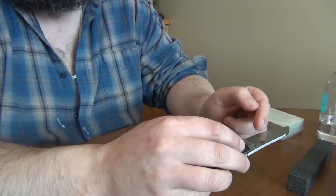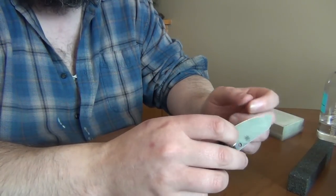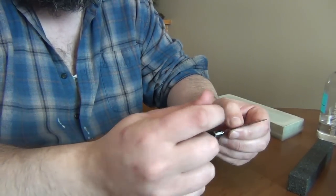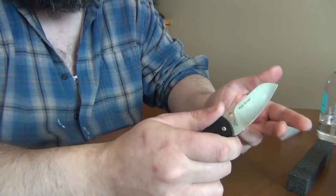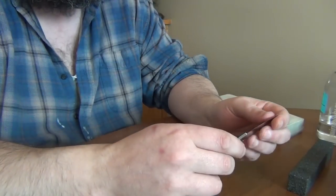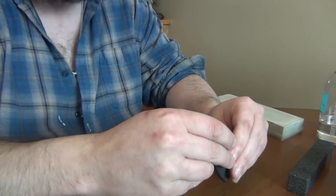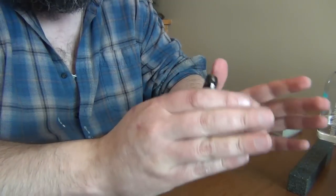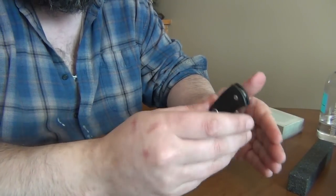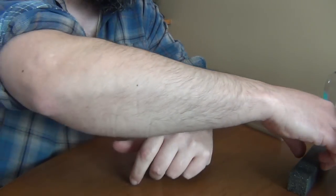They're great for working on the edge bevel. The same stones, however, are not very good for working on the apex bevel because that slurry again starts slamming into the apex, but you don't want it. At that point, you want a nice hard stone to just grind down the sides of the apex. And once you understand that on a basic level, a lot of the frustration will go out of sharpening, and then it becomes a point of experimenting with what techniques and grit finishes and stuff work for you.